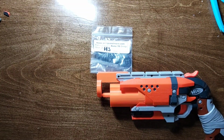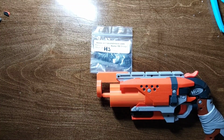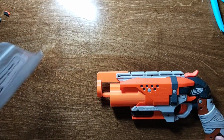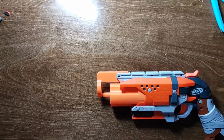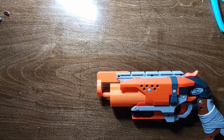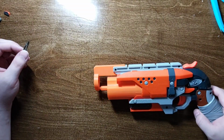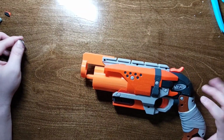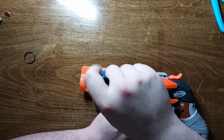O-rings. So a standard O-ring is a little bit smaller, a little bit thinner outer diameter. But the cross section is typically about 3mm, with a slightly smaller outer diameter. So if you can get a 27mm outer diameter, or thereabouts, O-ring, then you should be good.